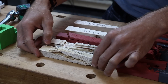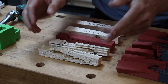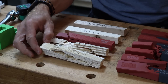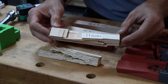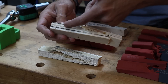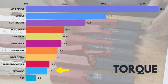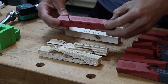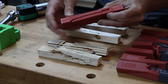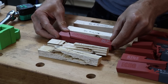Here are the results. We have OSB coming in at the very bottom — so far down that I could barely even get a reading. OSB may be good as a sheathing material but it isn't particularly good as a structural component like a rail. Next up we have the plywood — this is pretty lightweight plywood so I didn't expect great performance, but I chose it because it has essentially layer lines just like a 3D print does. It came in at 11 newton meters. Now this one surprised me a little bit: the continuous 3D print came in at 30.6 newton meters. It performed really well — it has somewhat of a spiral fracture with some fracturing on the layer lines as well, but overall 30.6 newton meters.